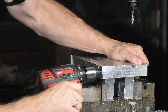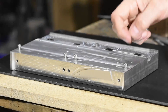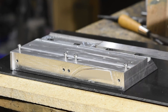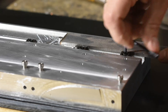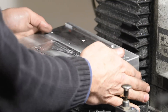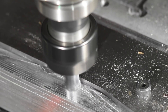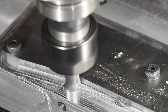I'll finish up by tapping the 8-32 threads. A little bit of hand cleanup, some chamfering and that sort of thing, and it'll be ready to roll. The beauty of this setup is that if you're not producing large numbers of parts, you can just set them up operation by operation on the pallet. Or if you really need to crank out a bunch of parts, you can run multiple pallets, setting the idle pallets up while one of them is running, then swapping them out as you go. The Pearson pallet system is theoretically repeatable to 3 ten-thousandths of an inch, so you can work to pretty tight tolerances without having to re-indicate or fuss around with each pallet when you swap.